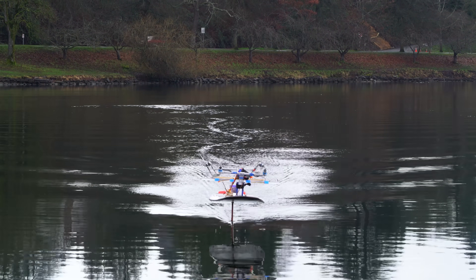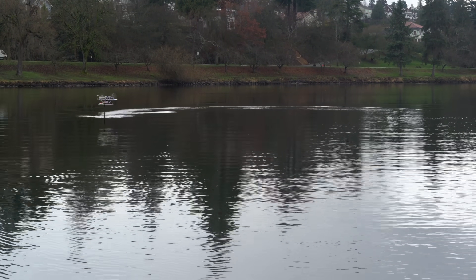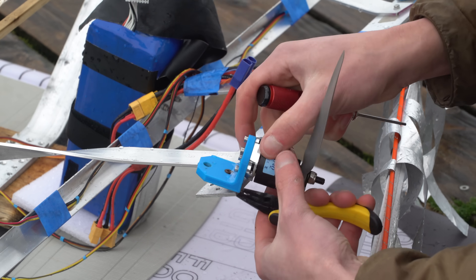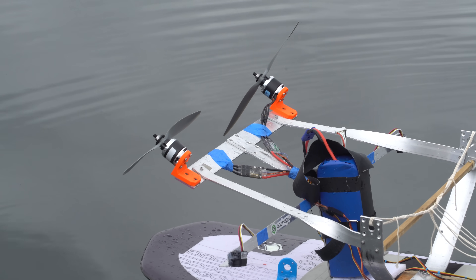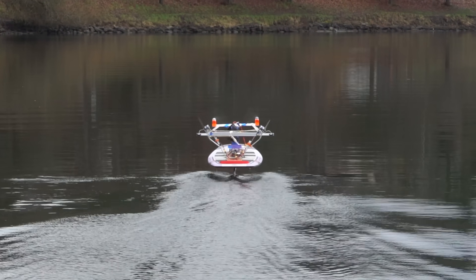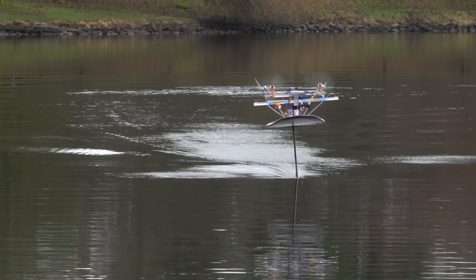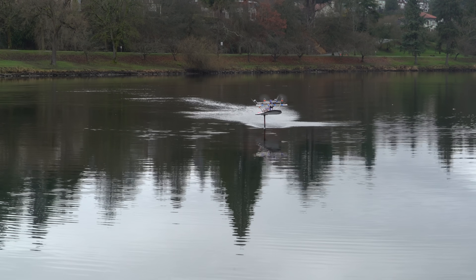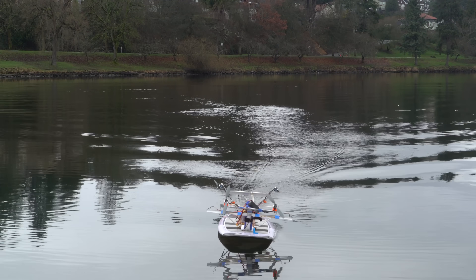At this point I had finally gotten it working well enough to do a full 180-degree turn. In my mind, that means we've surpassed the functional threshold and now we have a working vessel, if you can call it that. But there's still room for improvement, so the next thing I tried was replacing the blue motor mounts with orange ones that have a few more degrees of tilt. This makes the motors tilted up even more, which should give the throttle more influence on pitch. Currently the throttle is the only way to control the pitch — it's underactuated. So I tied the flight controller pitch control loop into the throttle command, so now the throttle level is a mix of both the pitch and the altitude controllers. That seemed to work decently well, but there's still the problem of not being able to control pitch and speed independently.